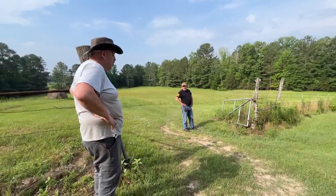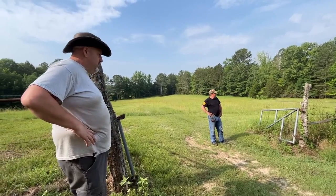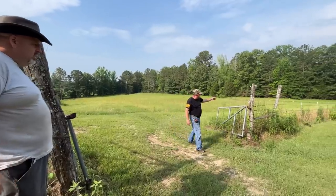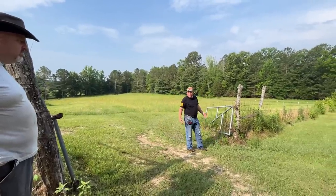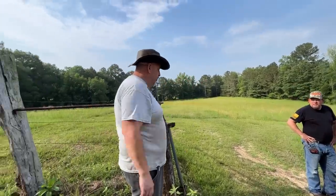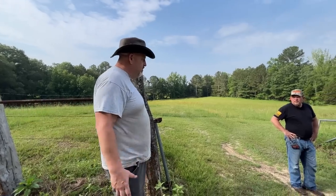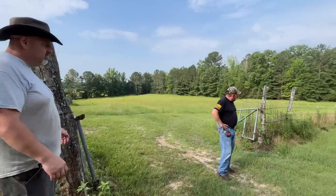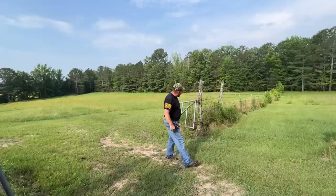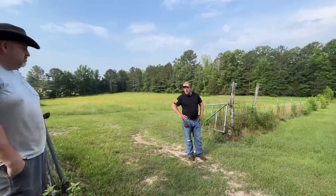The best thing to do is take the barbed wire down, because you got all those trees and everything that are in there. You plan on leaving the T-post up there? Well, they're pretty straight. In fact, they're dead straight. Yeah. So we might as well leave them. Well, I would pull the barbed wire out and then run your mower through there before we put up any fence, and then we trim around the post, just so you don't have all that mess that's going to be in the middle of your fence. Perfect. I got a bush hog on the back of one of the tractors. I can just back it in between them all. In fact, there's probably room to drive through there. Yeah. So we can put Braxton on taking barbed wire down.